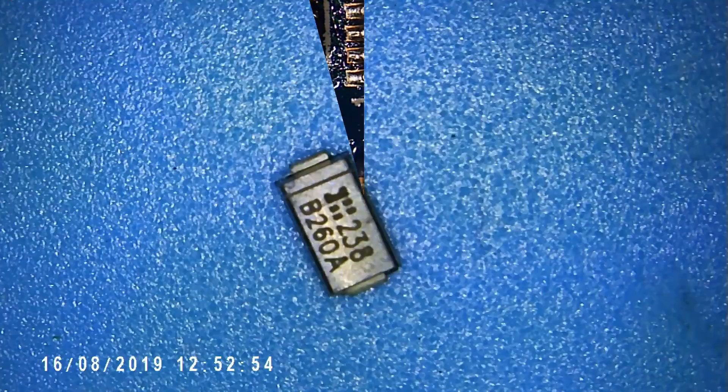This is the nearest component I could find on another circuit board, also in the power supply section. This is a 60 volt 2 amp Schottky diode. The challenge is that it is a little over twice the size of the original component, so it won't fit in the same place on the board and I need to find a solution for that.